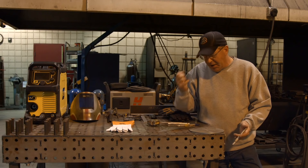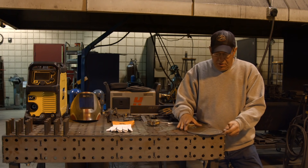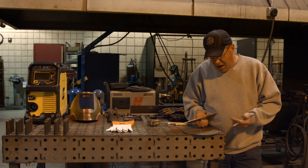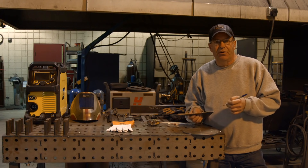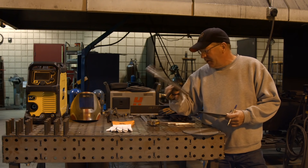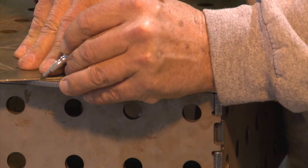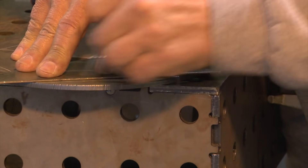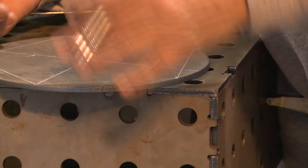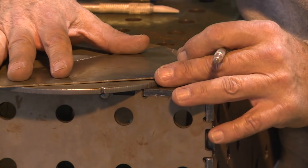So this is the piece that we had — we were working with it and I've already got a pentagon laid out and we were going to cut these lines. I also like to use scribes when I'm doing beam work, laying out bolt hole circles, anything that I'm going to drill. I tend to make a lot of tools here. I want to transfer this with a scribe and scratch into this for the simple fact that if I'm going to start cutting, my soapstone mark could go away from the flame — we don't want that. So very quickly, I'm just going to scribe these in.